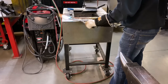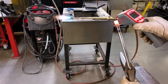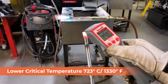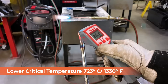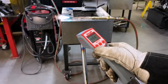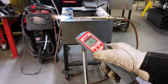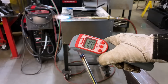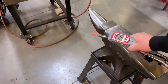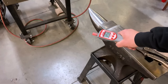One way to know when your material is ready to be quenched or tempered is to use a digital thermometer — this is the point-and-shoot type. For this application, we want to elevate the temperature to above 723°C or 1330°F for quenching. This temperature is known as your lower critical temperature or transition temperature — this is where your material begins to lose its magnetism. We then heat it again below 723°C or 1330°F to temper. This is where annealing, normalizing, and stress relieving take place — all different forms of heat treatment. Something less expensive like a temp stick can also be used. We apply the stick to the material and when it melts, you are at the required temperature. Temp sticks are often used when preheating and post-heating materials.